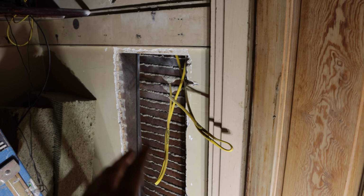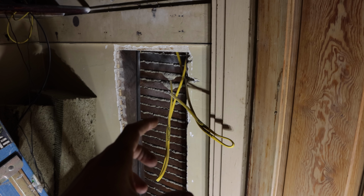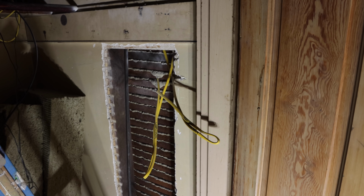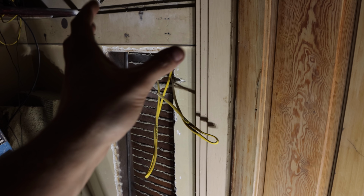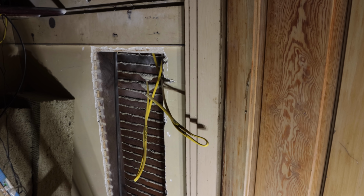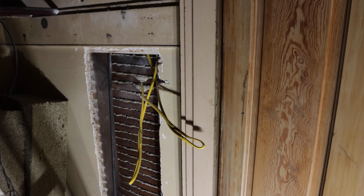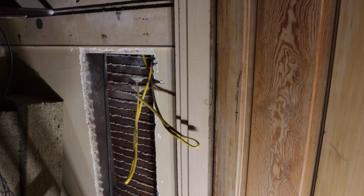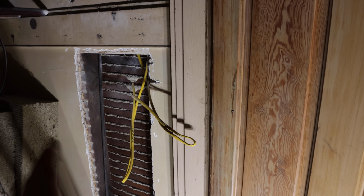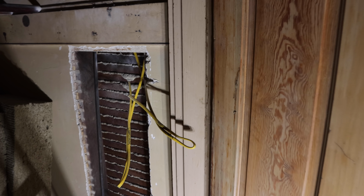and the reason why I'm doing this, and the reason why I'm putting one on the third floor as well, is because it allows me not to run every single wire down to the breaker box in the basement. I could run all the wires from here, save on wire, and punch less holes, and not have one giant line super highway like they did back in the day. I can kind of control things a bit more like this.